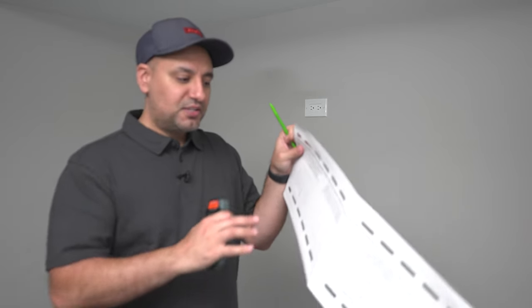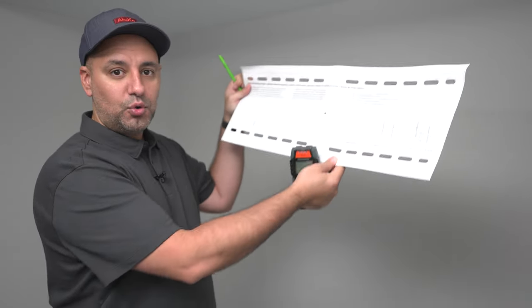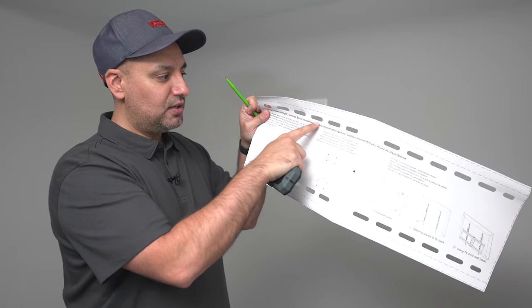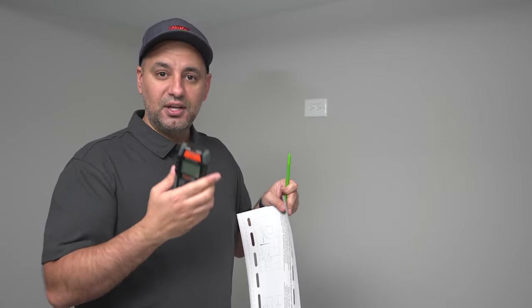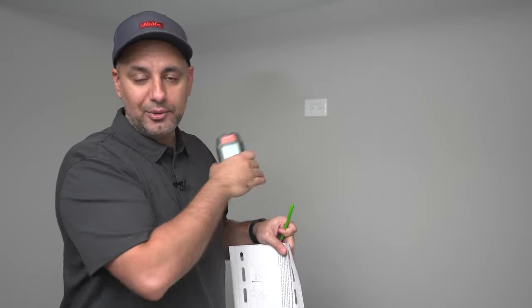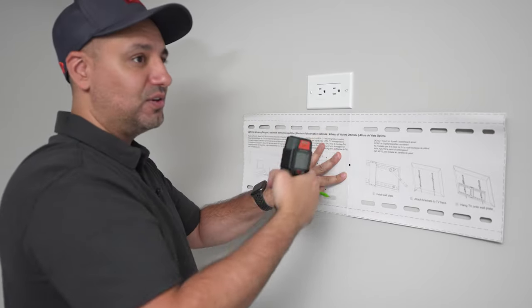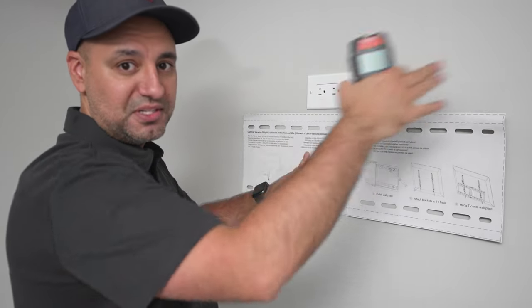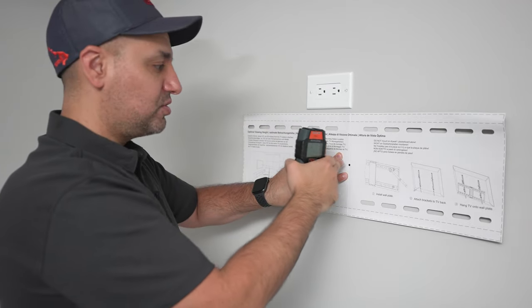This part is about marking where your TV is going to go on the wall. If you use the same mount I'm using, they come with templates — so instead of holding the actual mount, you can hold the template up and mark any hole you need. You need a pencil for those marks and a stud finder, because the screws need to go in the middle of the wooden stud behind your drywall. Studs are 16 inches center to center in almost all houses — some commercial areas are 24 inches. I measured this wall and the center point is right here, so I want the center of the TV to be here. Just measure from one end to the other and divide by two to find your center point.